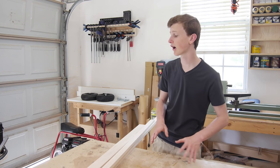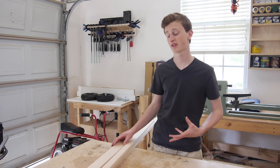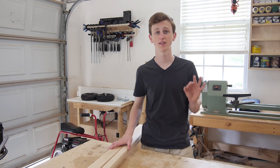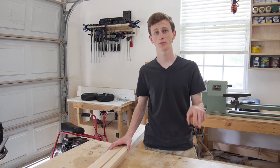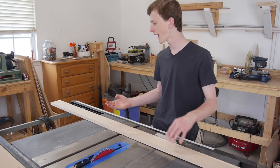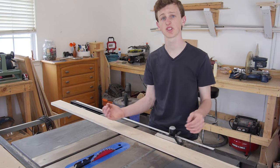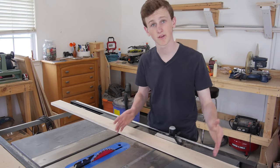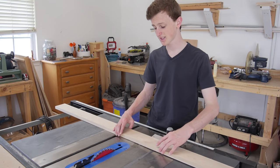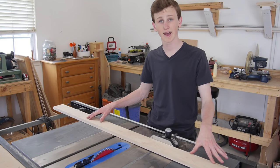The first thing I want to do is set all my hardware and my tires aside. I want to focus on the woodworking portion of this project. I'm going to take all my wood, head over to my table saw, and cut all the lumber to the exact dimensions — those will also be in the description below. For my first cut I'm going to take my 1x4 board and cut it roughly in half. Then I'm going to take the two halves and glue them together to get a wide enough board. If you can purchase a 1x7 you can skip this step and just cut it to the final dimension of 2 feet long.